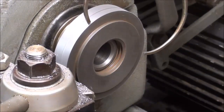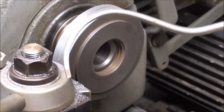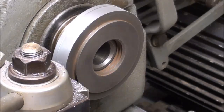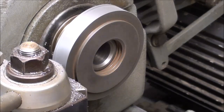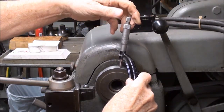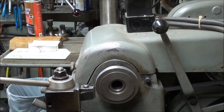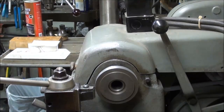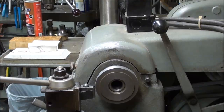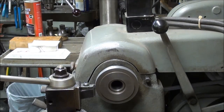This is about the tenth pass. The caliper now slips over it, so from now on I will use the micrometer. That means I'm getting fairly close — I'm within about a sixteenth of an inch. There's ten thousandths to go, so we'll take that in one pass. This will be the last pass. It wouldn't matter at all, even if I was about one sixteenth of an inch under — it looks like some chucks are built that way.